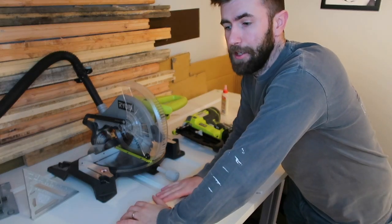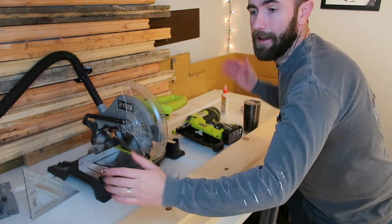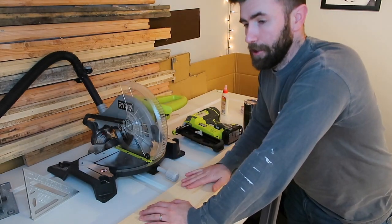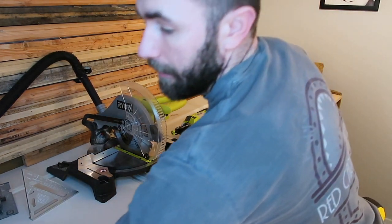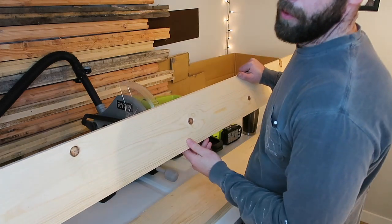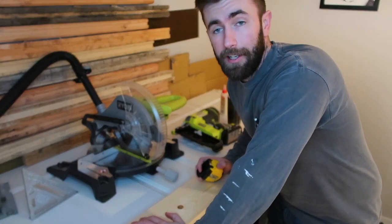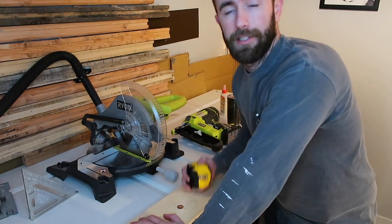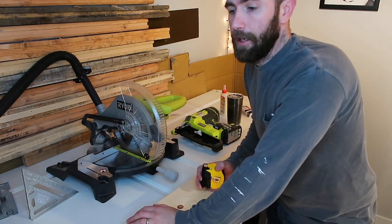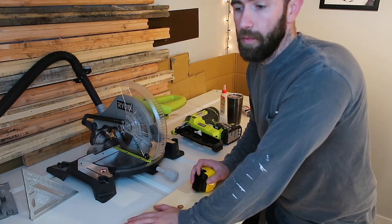The first thing you're going to want to do is measure out your pieces and mark what you're going to cut. I measured my fireplace — it's roughly six and a half feet in width — and I want my mantle to be about six inches in from both sides, so about a foot in total. That means I'm going to cut my board at about five and a half feet. The front piece and both side pieces of the mantle will be the 1x6.